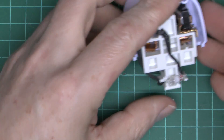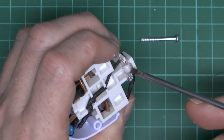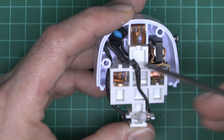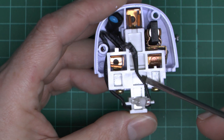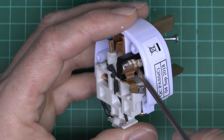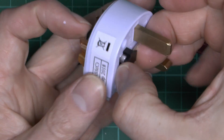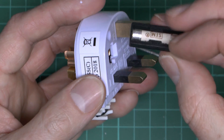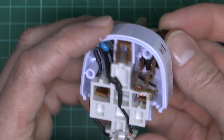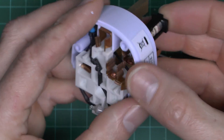There's a little green indicator on the front, and we can see it appears to be a neon — one of those which were orange once, but with a phosphorous coating on the inside, so it will glow a fairly dull green. They don't tend to last very long either, the phosphor-coated ones. Inside we can see the actual socket contacts — just three of those — with wires going over to the neon and a little resistor under there. Here's the fuse on the side — again a 13A job, normally accessed from the outside. We should be able to just push that out. There's the fuse — one of those SEM ones, a fairly common reasonable brand. So it is fused, and we can see the pin connects directly to that.